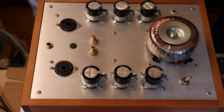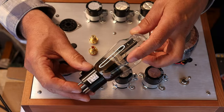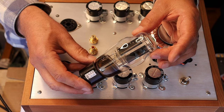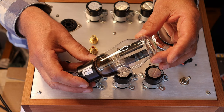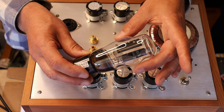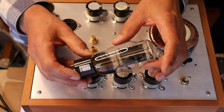The modern copies just aren't the same tube anymore — in many cases they're not on spec. Chinese factories have a tendency to try to 'improve' the spec. Here's a great example: this is an original Svetlana 5U4G rectifier tube, a twin tube — a full wave rectifier. It's a very common tube used in many of the better quality Chinese amps that have a rectifier in the power supply.